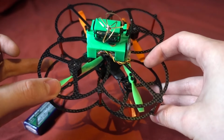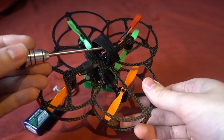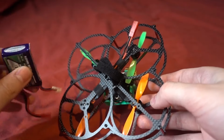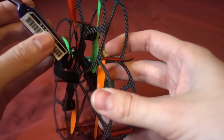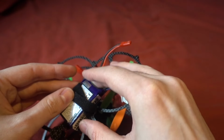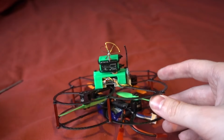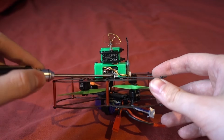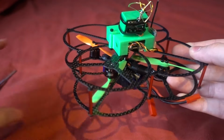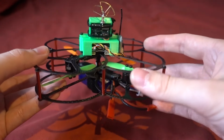You don't get a lot of other stuff with this. This is everything that you get. So we have got this Velcro strap under here. It's one that doesn't have a feed through, so I always find it quite difficult to get the batteries in tight, but if you sort of crisscross them, then you can do that. Also, the battery is going to sit diagonally. There's no board alignment with this, however, funnily enough, so the flight controller is sitting flat on top. It's only the battery that is going to sit at an angle, so I hope that doesn't upset the weight distribution.